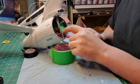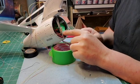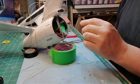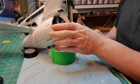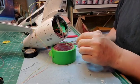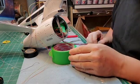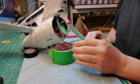I got the landing bay lighting hooked into the main line here. The whole ship's going to be run off of a 9-volt power supply. For the white lights in this section here, I'm going to have to put a resistor on. So I'll probably put the resistor on in the stand here. If that's the case, then I can take the resistor off of the primary hull.